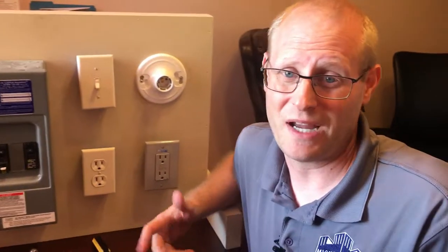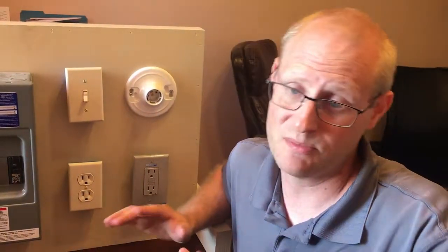In closing, there's three general times that it's great to do some outlet maintenance. Number one, anytime you paint a room is an awesome time — you're already working on those cover plates anyway. The second time is if you're moving into a new home; as you go through and you're moving your stuff in and plugging things in, tighten things up as you have a free minute. And the third time is when you happen to unplug the vacuum cleaner, you notice that outlet's loose, and you can add it to your Saturday weekend warrior list. Have a great week. We hope that you follow us on YouTube or check out mightyfortressacademy.com and we'll see you later.